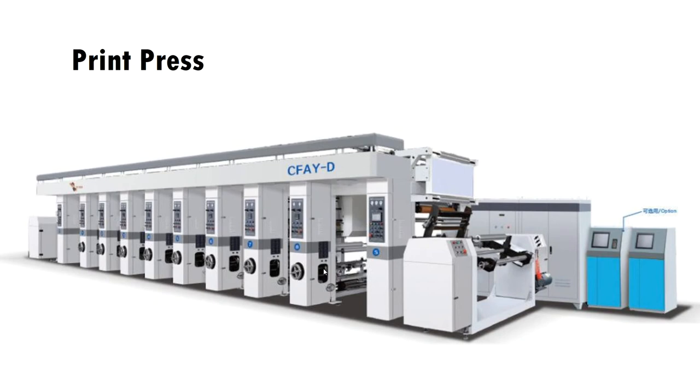One cylinder, one print unit to print one color, and then another one, and then another one, and then all the colors are printed on the machine, and your artwork will finally be printed, presenting to our human eyes the actual color effect. So up to now, we can explain why a package design always needs several cylinders to print.